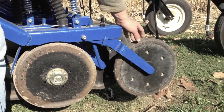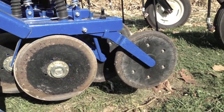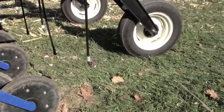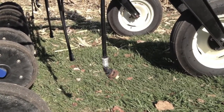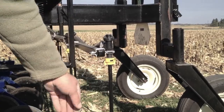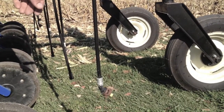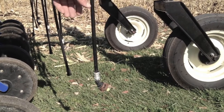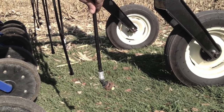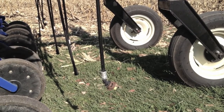In addition to planting the cover crop, we can also side dress the primary crop — the corn that's growing there — with a nitrogen fertilizer. We're actually doing that in what we consider a precision application where it's four inches off the corn row. If conditions get dry and the roots of the corn don't grow far, it's close enough that the corn can still utilize it. But it's also adjacent to our cover crop zone so that we're not burning the freshly seeded cover crop plants with a high fertilizer rate.